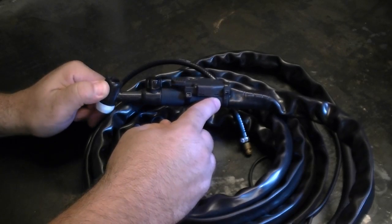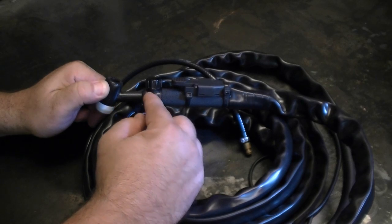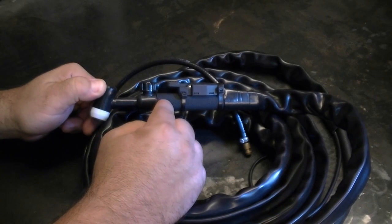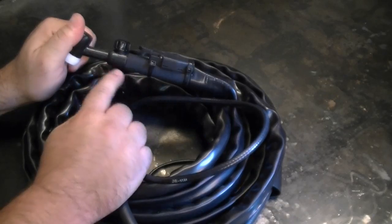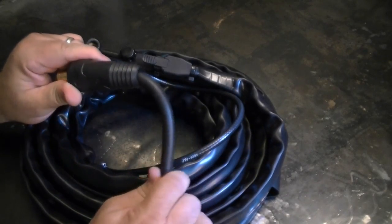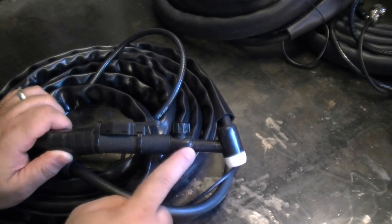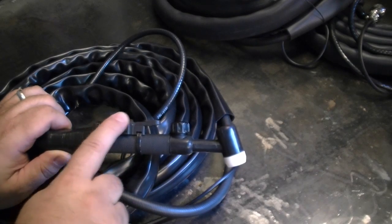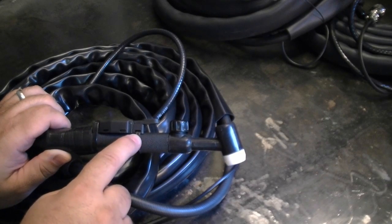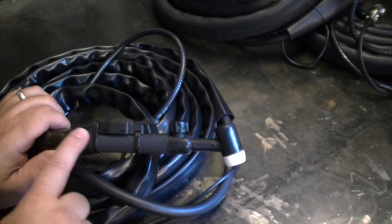Let's take a look at some of our optional torches. This is a 17V series — available as a 17 or 17V, where the V stands for gas valve. This torch is supplied with the European type handle with the PowerArc 140ST. The 17 is a smaller, more agile torch with a lot more flexibility in the line due to its single gas line and cable design. Just like our stock torches, all our optional torches come with a 2T/4T switch attached to the top of the straight black handle, held on with zip ties. The switch can be removed or replaced with Velcro if needed.